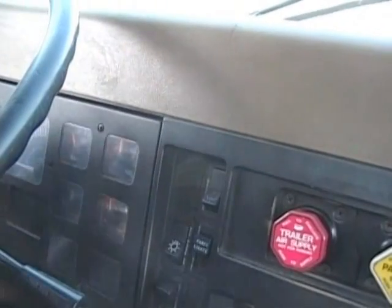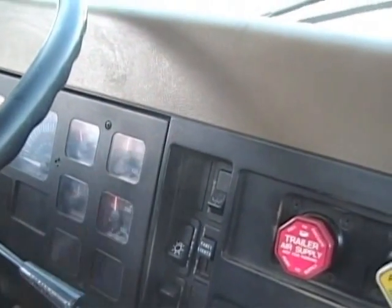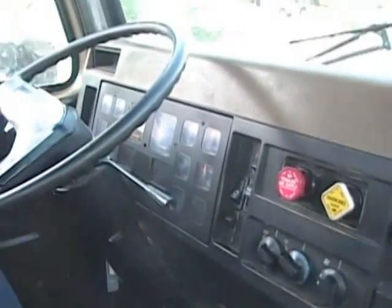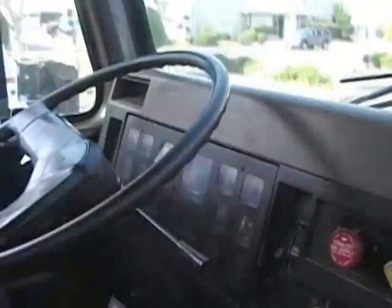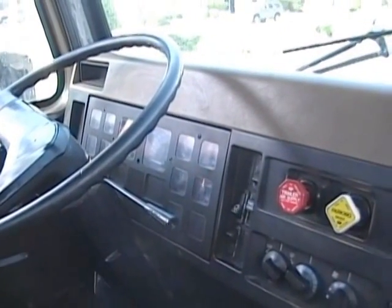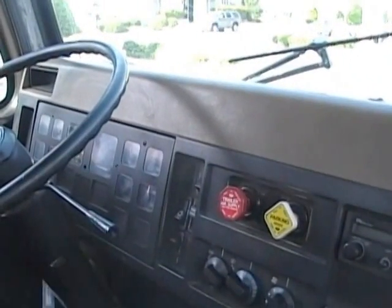Okay, there's my light, there's my other buzzer. My primary gauge looks to be right about 72, my secondary right on 70. So that's a good test. Did not fall below 55 psi. Remember, that light has to come on no higher than 75, no lower than 55. Okay, I'm going to reapply my brakes, start my engine up, build my air pressure back up to about 100. I'm going to perform a tug test. We're just going to test each individual brake on the tractor.